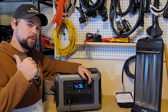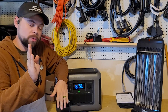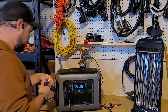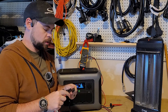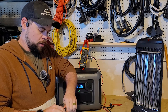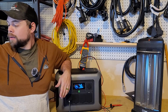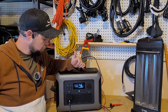I want to connect a solar panel. I've got a 400-watt solar panel outside — it is 3:15 in the afternoon, so the sun is already just outside of solar peak hours. Let's get a voltage check — we're getting 37.4 volts, which is exactly what I would expect. At full power they do about 11 amps. Before load is called VOC or voltage open circuit, and the other is VMP — voltage at max power — and voltage is lower at VMP. I'm not expecting 400 watts right now, it's a pretty clear day but it's not ideal solar peak hours. We're getting a little over 200 watts, which is what I would expect for this time of day.